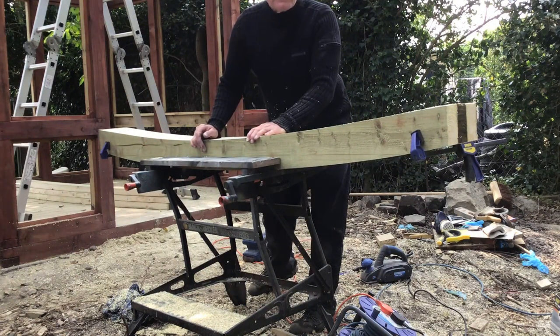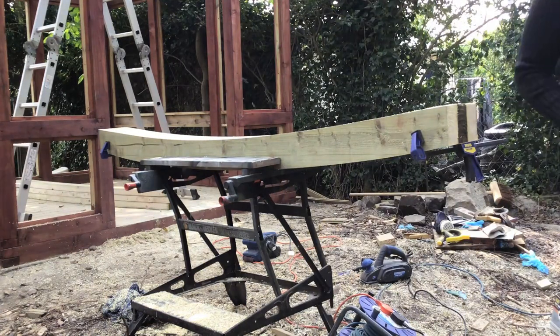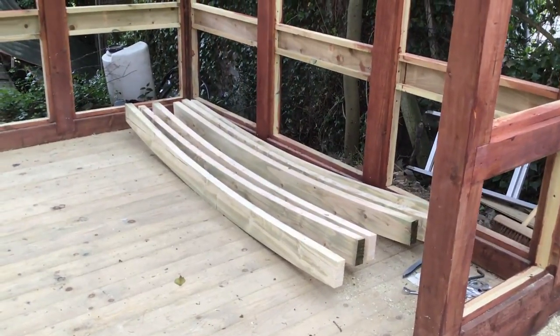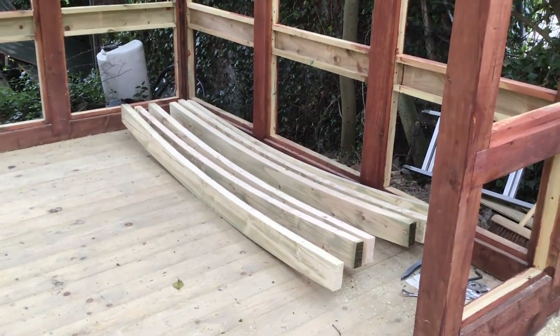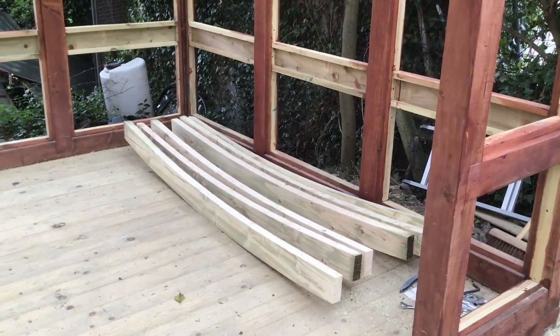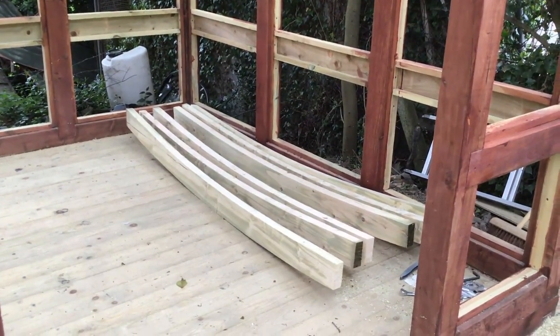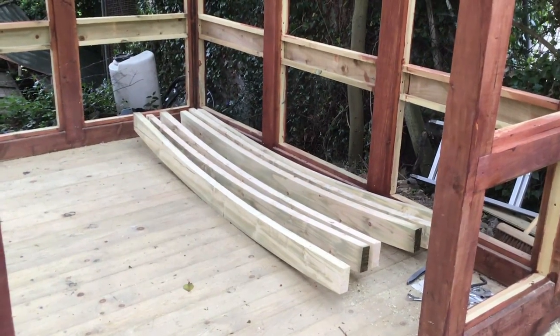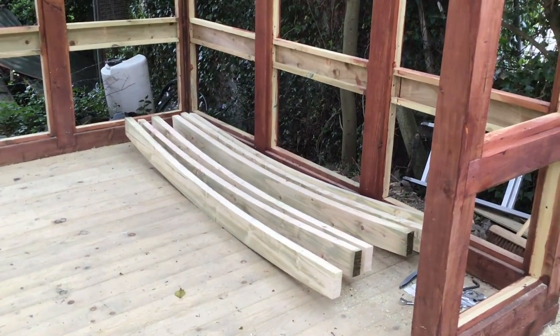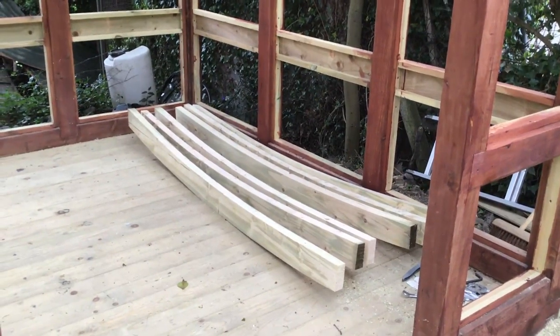After that I'll cut either end — one for the ridge and one for the outer edge of the roof — and I'll cut them to shape and show you at a later stage. There are the two sets: set one and set two — one for the front of the roof and one for the rear, in sets of three. All identical, planed and sanded. Now all I've got to do is cut the ends of the rafters to take into consideration the angle of the ridge and the base of the roof. I'll cut one to shape and use that as a template for the rest.